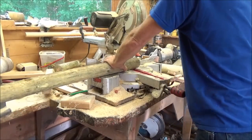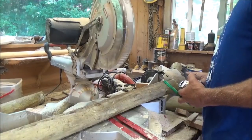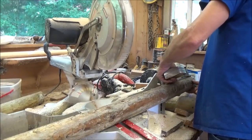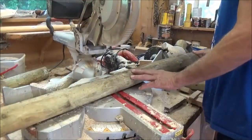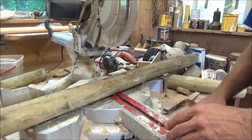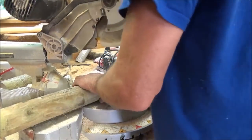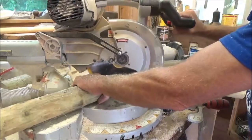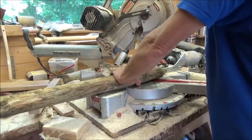The first thing I'm doing now is just cutting that 15 degree angle on the top. For some reason on these chairs, there's a little bit of a difference — this is bigger up here than it is down here, and they always seem to put the bigger side up on top. I don't know if there's a reason for that, but I'm doing it the same way. So I need 30 inches here and I need to put a 40 degree angle on this part. We have to remember now, unlike the other one that was long to short, we're going to do a long to long, so I need to switch this around and go this direction.